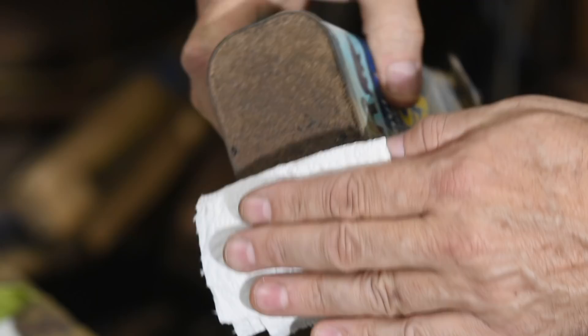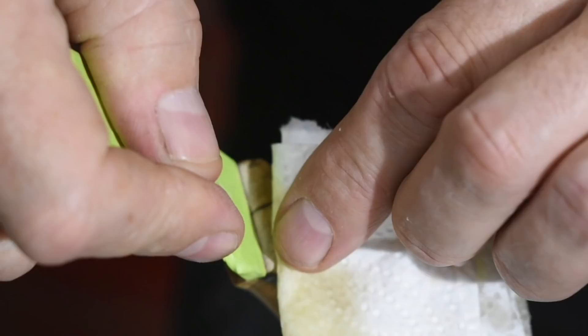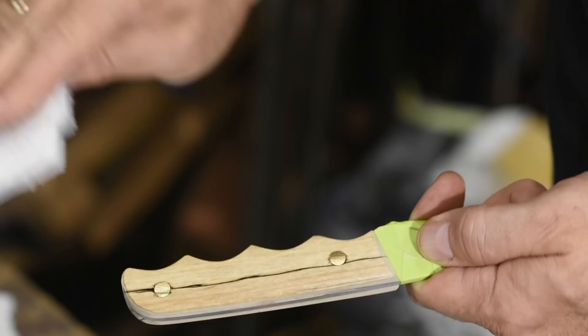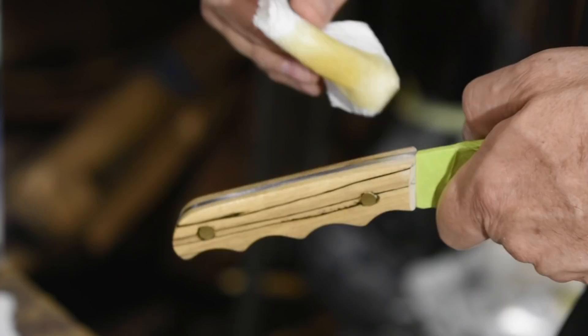Now for the wood finish. There are about as many wood finishes as there are knife makers. But for wood-handled knives with relatively soft wood, especially ones with some figure, I tend to use tung oil. Nothing magical about it — it's just what I like. It darkens the wood and gives you a soft sheen without a whole lot of plastic-y buildup like you'd have with polyurethane or something like that. Basically, just rub it on, let it soak in, then reapply several times over a few hours. Once you have the amount you want on, let it cure a bit, then buff it out with a soft cloth.